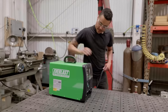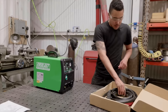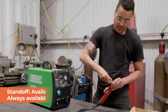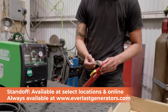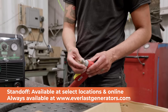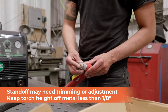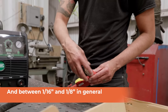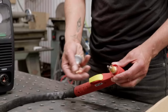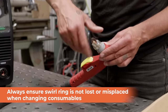Save the machine itself — she's light. I dig the color. Here's our torch. We're fortunate enough to actually have a standoff. You can get these obviously online or any welding supply should have these standoffs. That is allowing you to have that distance away from the material so you are not destroying the electrode. Inside here: electrode, tip, cap.